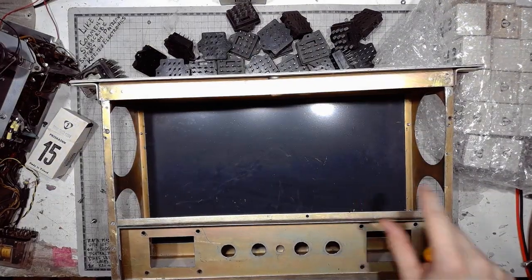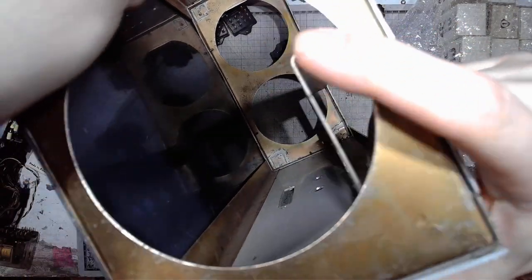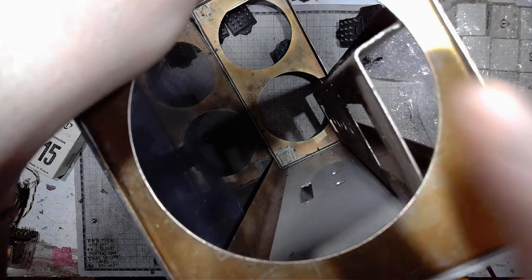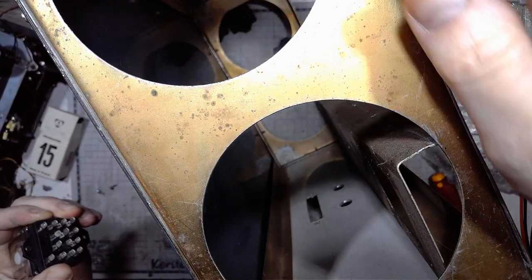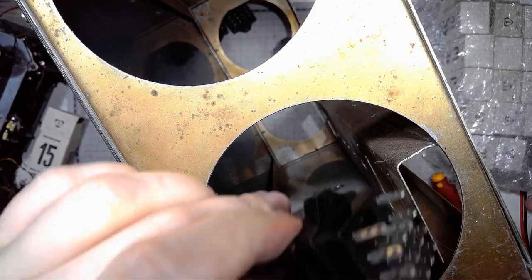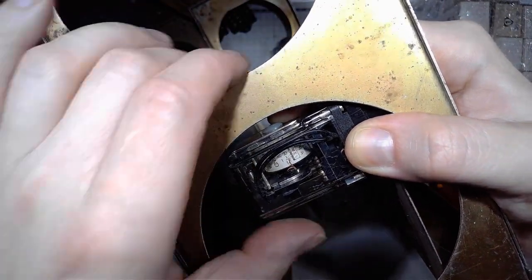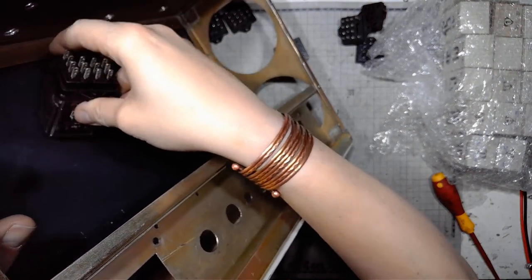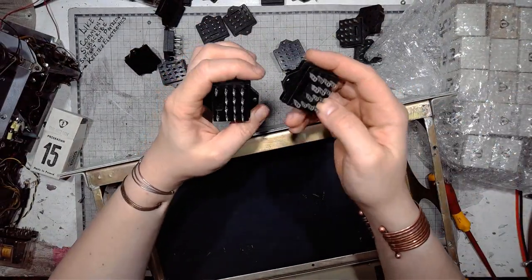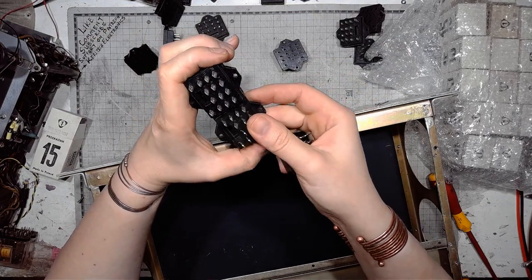Oh, it was the bottom part, but if you take a look, there's a resin plate on the back, and I can use this plate plus some standoffs and mounts to attach a bunch of relays pretty comfortably, putting them above the bottom of the chassis, and then there would be a lot of wiring to be done on the underside of the relay bases.